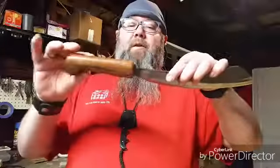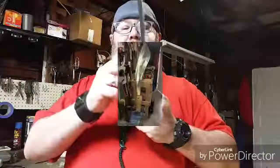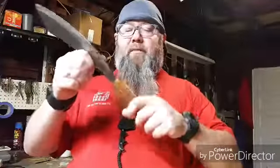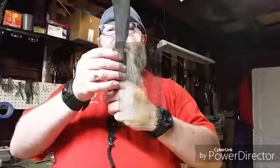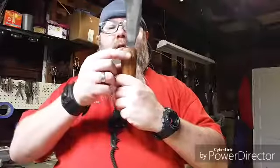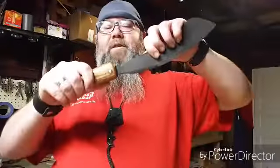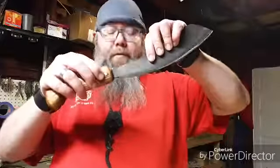When I did epoxy it all together I had to use shims to fill in different areas because when I burned it in it did move side to side — I'm not sure why, maybe I was touching the sides when pushing it in. I put shims in here with epoxy and hammered them down so they're nice and snug. Then I put in the retaining pin, filed it down so it's flush with the handle, and peened it down. The only reason for the pin is added retention — I have full faith in the epoxy and the shims, but it just added security for me.